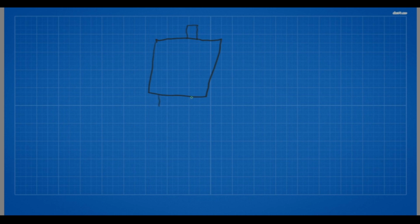Right, DC motor. It has two states. This is a DC motor. At the bottom are the pins. For now, we're going to call them A and B. Now, when we connect it up, depending which way the potentiometer is turned, if it's turned clockwise, this becomes plus, this becomes minus. Now, if we then turn the potentiometer anti-clockwise, this becomes plus and this becomes minus.